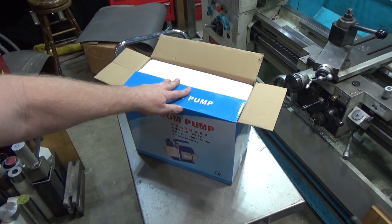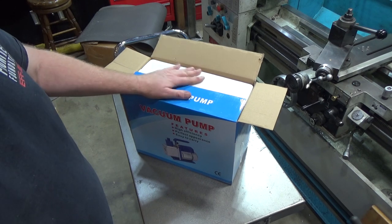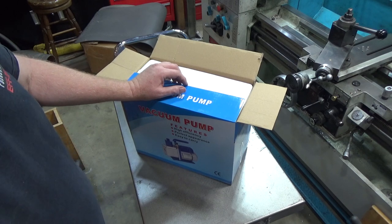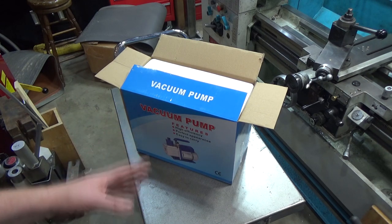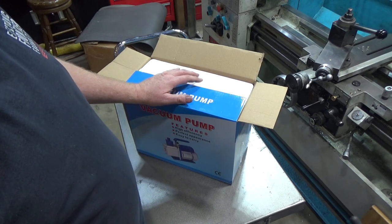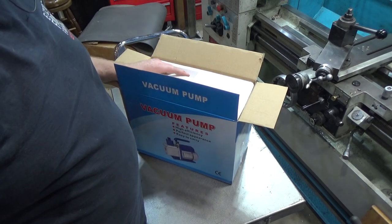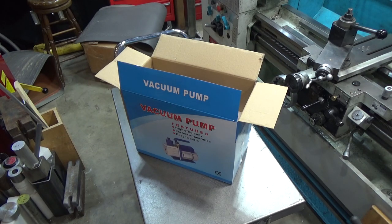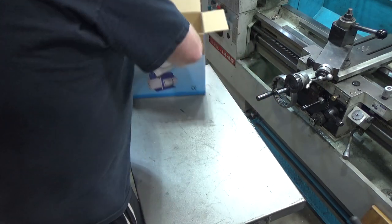This pump is an oil-based rotary vane pump, like my other one. There are also non-oil-based pumps but they're a lot more expensive, and they have components that wear out even faster than oil-based pumps. They do have the advantage of not getting oil everywhere. On my other pump I put a filter sock over the exhaust, and I'll probably give my sister something similar for this one.